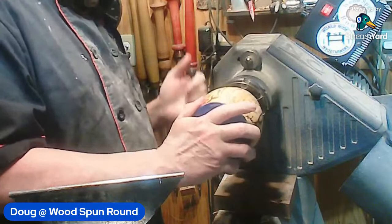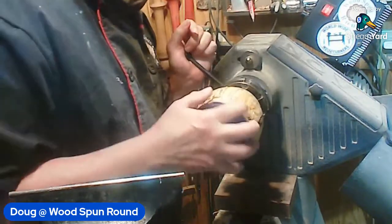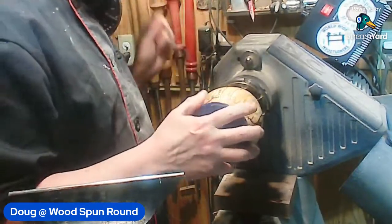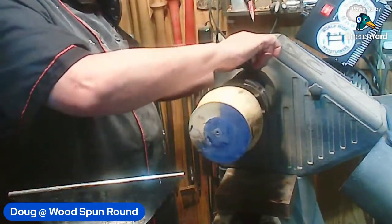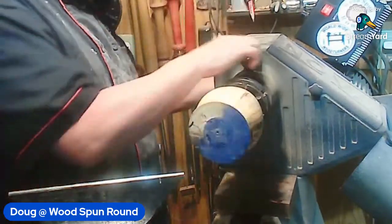Oh, that's why. That's why it's always good to check your chuck. Anytime you do anything, check it. Make sure it's tight. I've had more than one piece fly off.